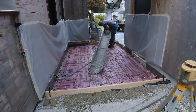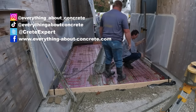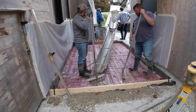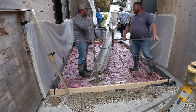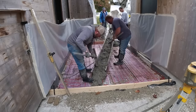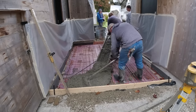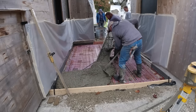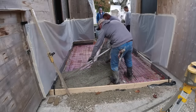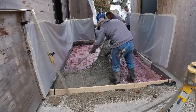So what makes this a $20,000 slab? First, I was contacted by the architect who built this house — they're the ones that hired us to come in here and do this slab. All we were hired to do was pour and finish the concrete. When they contacted us, they said they would do all the prep work. There was an existing slab here that was all salt damage from throwing de-icing salts on it, so they busted that out and came in, put down the styrofoam, put up the forms, and put up the ISO strip up against the wall.